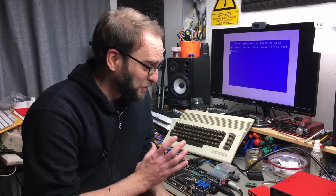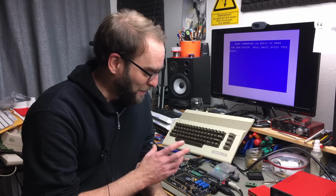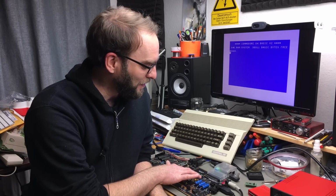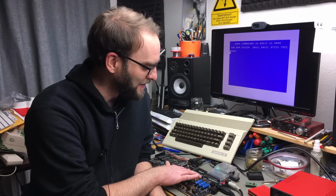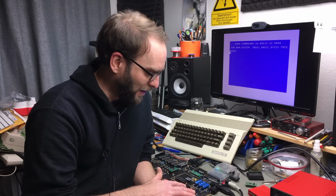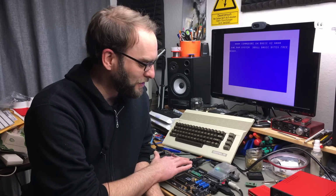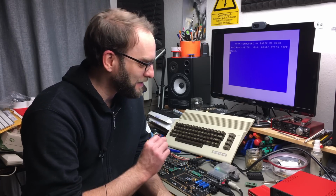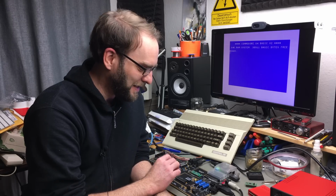Obviously, I ended up playing with this for several hours, and it seems to work flawlessly from what I can tell from my testing. The ARMSID sounds amazing. The quality from the RF modulator replacement is amazing. The timing chip and the PLA replacement work flawlessly. The voltage regulators work flawlessly as well. I think if we had an original SID in here, we would get the farting noises I made the video about ages ago.